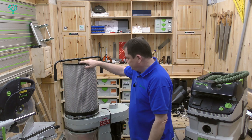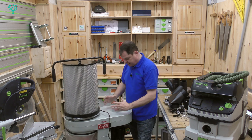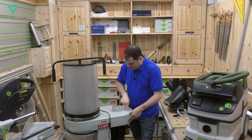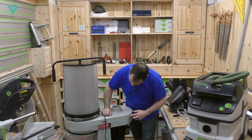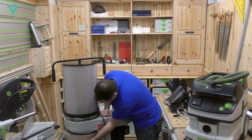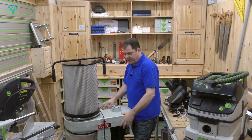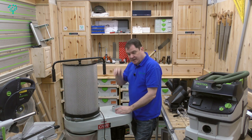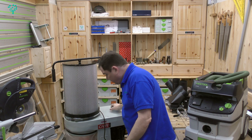This works on impeller. On the bottom of this there's a big motor, and sitting on top of that motor is an impeller. All that happens is the impeller spins round and sucks air into this connection, throws the air in to create a cyclone inside the bag. The heavy particles fall down into the bag, and the dust comes up into the filter where it's filtered and clean air is expelled. So there's no vacuum involved at all — it's basically just an air mover, like a big propeller. Think about a fan in your bedroom in summer spinning and blowing air on you — air is being sucked into the fan and blown out again. Exactly the same thing on a bigger scale.